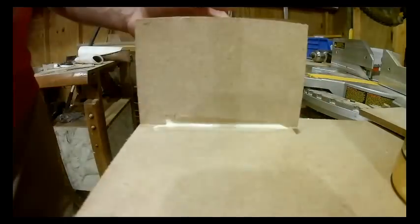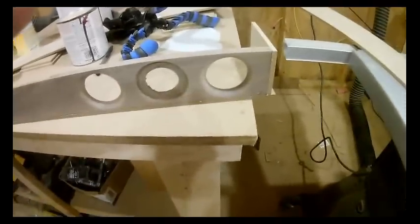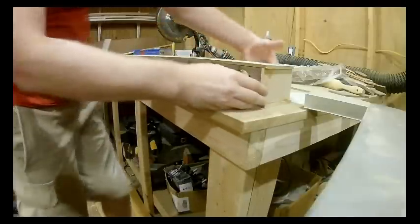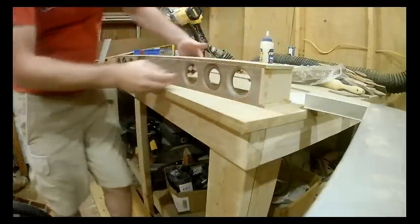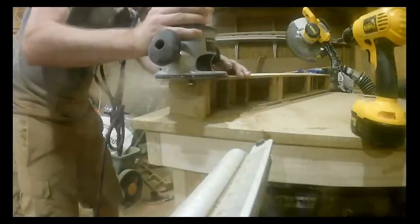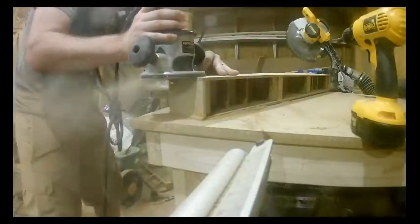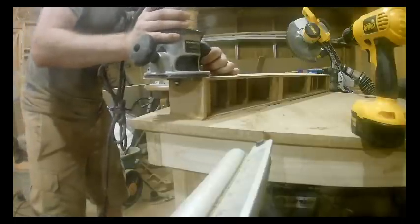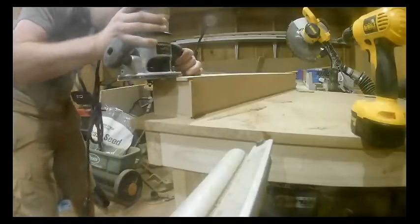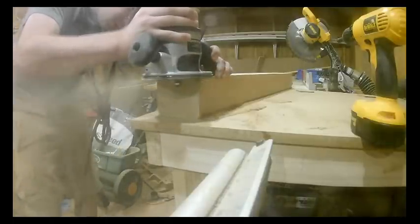There's no reason to have it cut perfect — most of the time you won't, and you'll end up with a box you're not happy with. Once you finish that, glue on the top, again using the front and rear baffle to make sure everything is nice and square. Then flush trim the box: put a flush trim router bit on and run it over, and you should have a nice, very solid square box when finished.